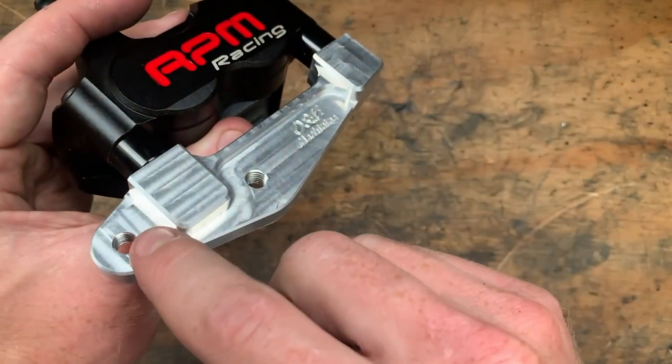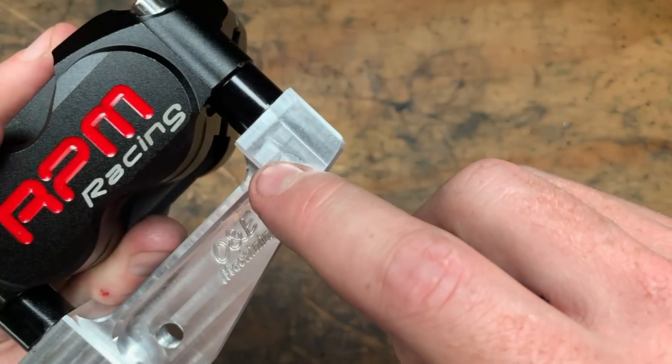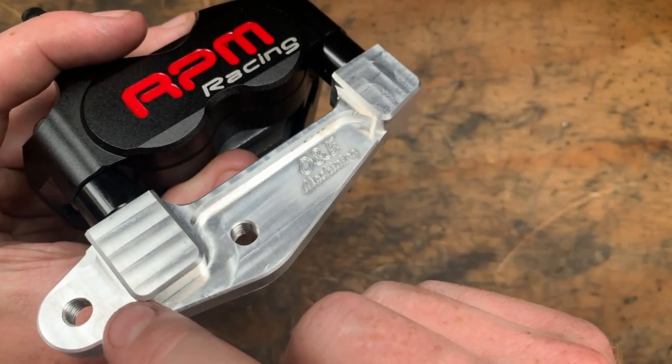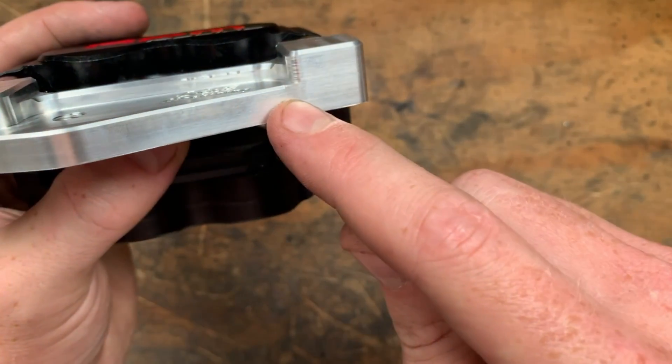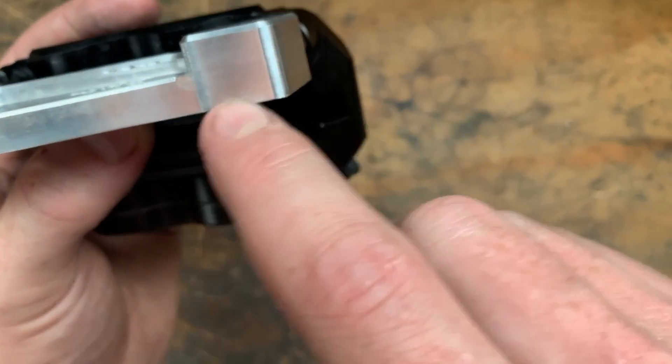I used Fusion's flat feature to get a nice step-over while ignoring the walls on all the flat surfaces, some chamfers, and I used the contour finishing pass so there are no vertical lines in the part.